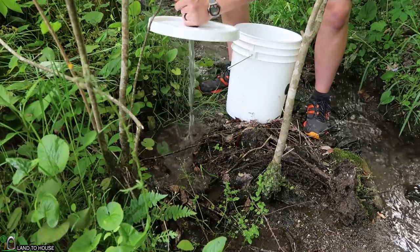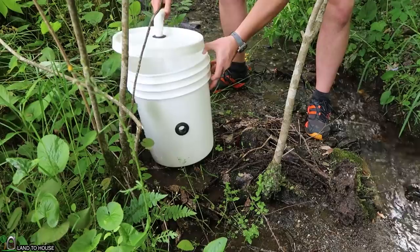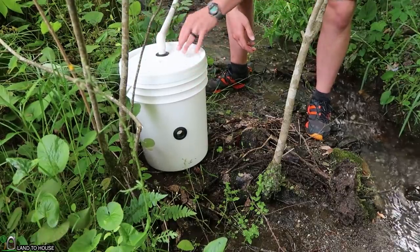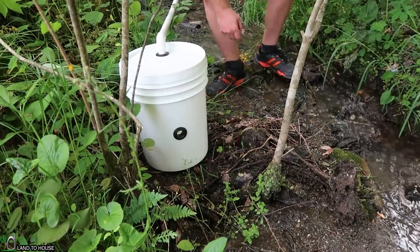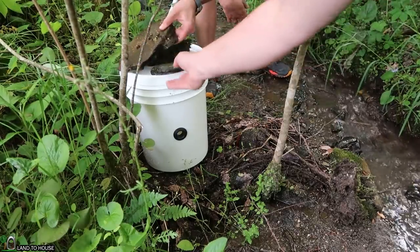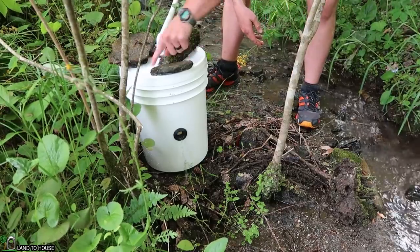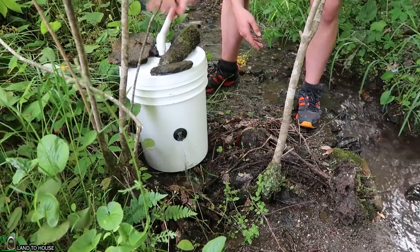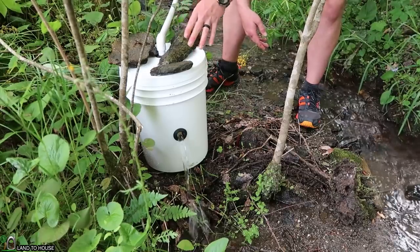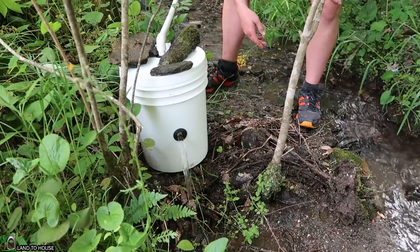All this is pretty much low pressure so it shouldn't blow out. You may just be able to put a rock on there to keep the lid down rather than locking it. Now we have more water than the ram pump is going to use, so these little holes here will squirt excess water out. Because this bucket will be full to the top, we will also have this additional head pressure being used, which gives us even more potential for the ram pump.